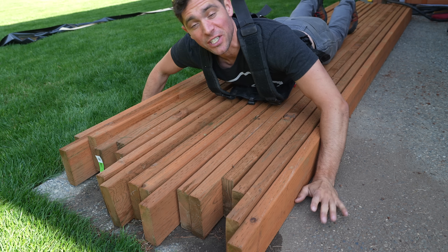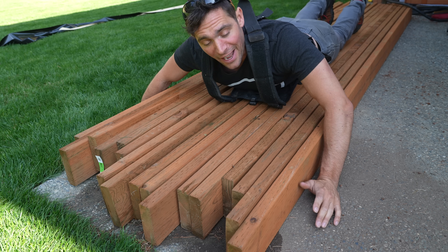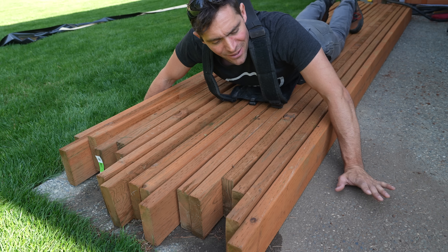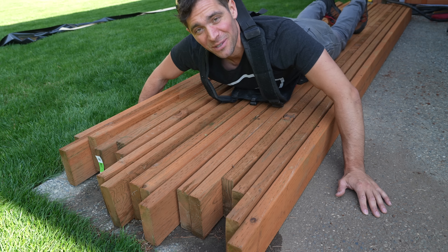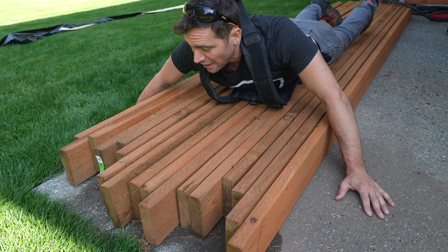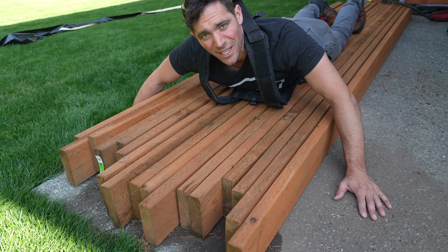On this project we are using 2x6 pressure treated lumber, which is plenty of structural support for a project this low to the ground. I always line up our joists to check for any ridiculous high spots, low spots, or warps. Yeah, a board that's so bowed out is not going to work properly, so double-check your pressure lumber before you start the installation process.